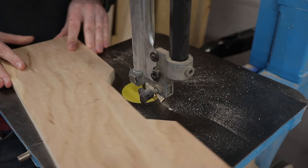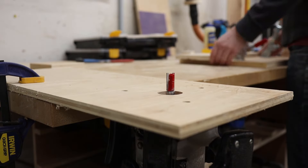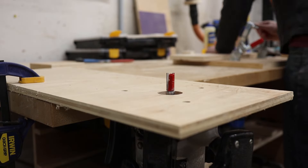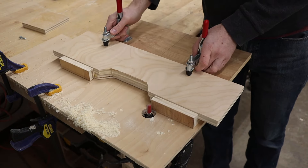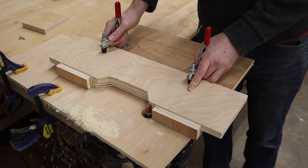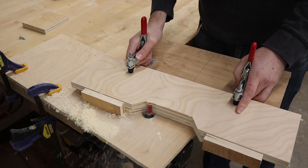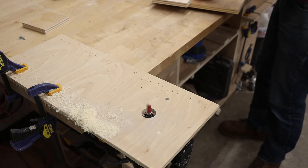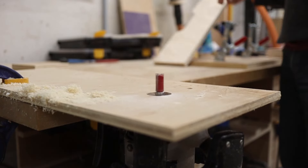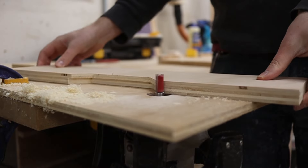Removing the waste is pretty important if you don't have good dust collection on your router. Now that I have the rough shape cut out, I put the drawer front back in the jig, making sure it is centered, and then use the template bit to cut the shape of the drawer-pull cutout into the drawer front. Since my template bit is pretty short, I had to take the drawer front off the jig and run it past the bit again to cut all the way through.